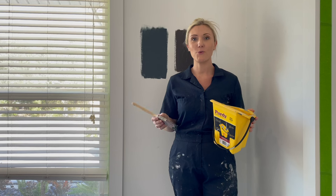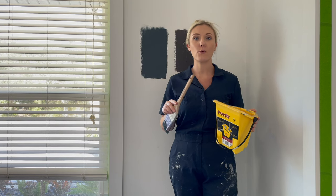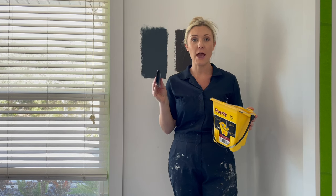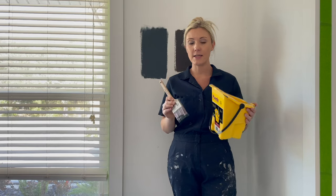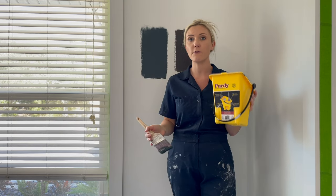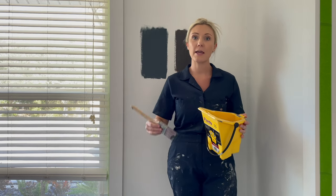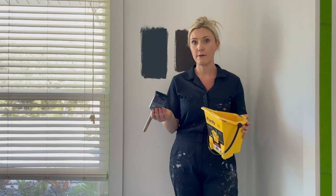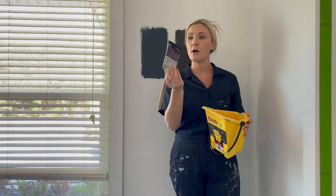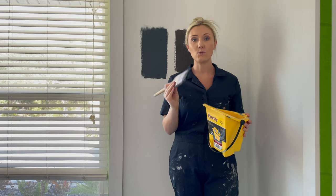All right, so we're ready to start painting the room and the first thing we're going to do is the edging, which is also called cutting in. That means we're going to be going around the edges of all of the surfaces and doing about a six-inch border using our paintbrush. I find it's easiest if I pour some paint into a hand pail like this — it has a little strap, it's easy to hold and to be mobile, and it prevents me from constantly going back to my paint can to dip my brush. I'm using an angled brush, about two and a half inches, and I highly recommend using an angled brush — it's going to help us get really crisp straight lines as we're edging in.